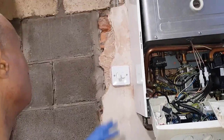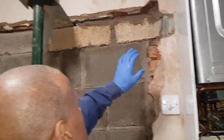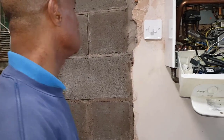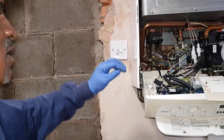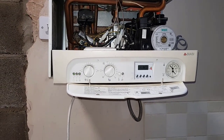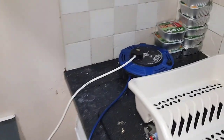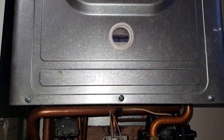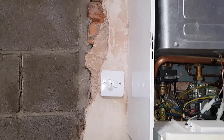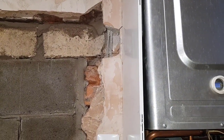The conclusion is that there's something wrong with this wiring — bad building work. The customer said it happened when this work started; it just popped. You can see that's disconnected, no fuse in there, no connection to the boiler whatsoever, and it's still blowing the fuses. So what we've now done is wired the boiler directly to a plug. There's a dead short circuit — damaged cable — so that's now disconnected and there's the plug on the extension lead.